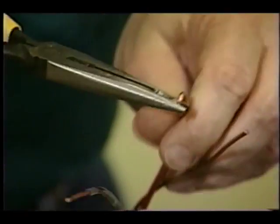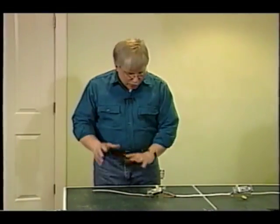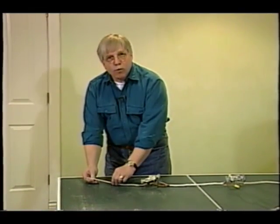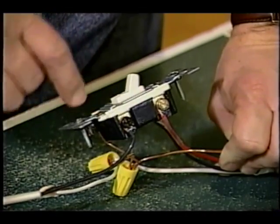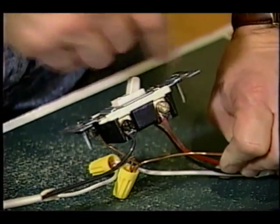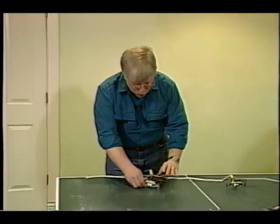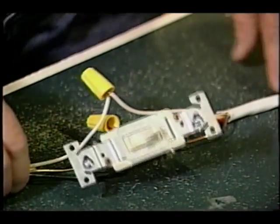Make sure that when you make the loop in the wire, you're bending it in a clockwise fashion. Insert it behind the head of the screw so that when you turn the screw, it closes up the loop. Here's the circuit I've built. Here's where the cable comes from the circuit breaker panel — it's the one that's got three wires in it. The black wire from that cable is attached to the first black screw in the first switch. The brass screw gets attached to the red wire that goes between the two three-way switches. And the other brass screw, you attach the black wire in that same wire going to the other three-way switch. The white wires and the ground wires are wire-nutted together and they just pass on through the system.